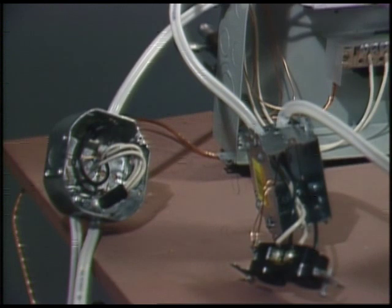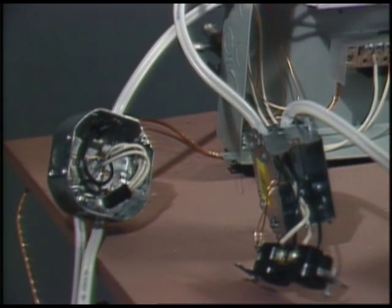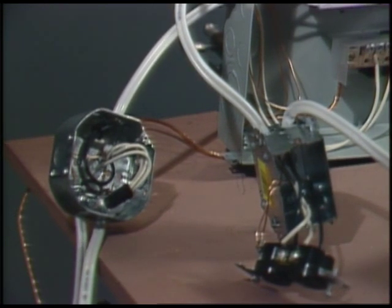This also demonstrates what the fuses or circuit breakers are for. Resistance isn't just a factor in wire heating. Every connection in the system can be a sore point. A loose connection can develop resistance in several different ways. No matter how the connection develops resistance, it results in heat. For this reason, all connections of any type have to be in metal or approved plastic boxes.